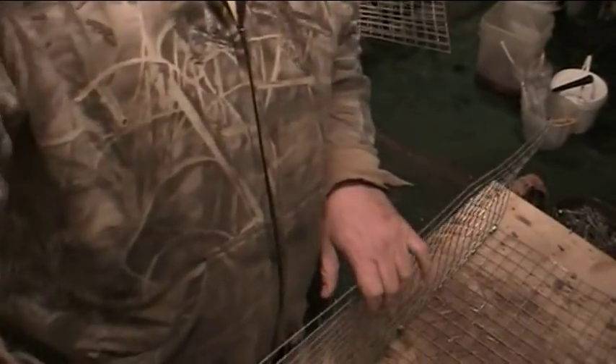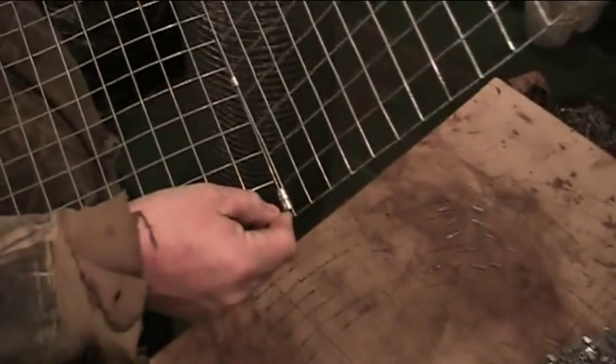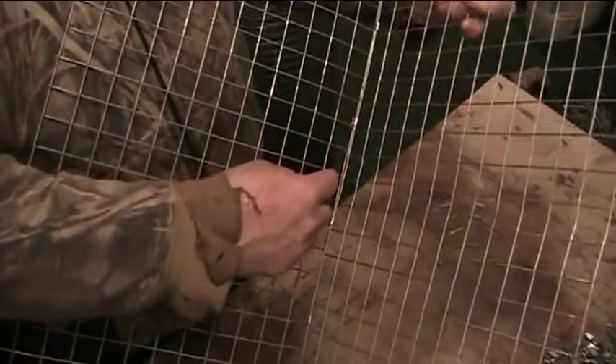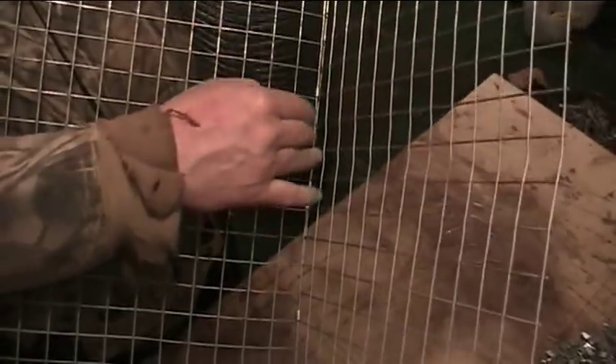So you see here we've got all four pieces cut out — 36 inches long, 12 inches wide. The first one is put together. When I use j-clips I put one every fourth hole. Put two on the end so that at least one spot has two, which stops it from sliding too much. Three spaces in between, so every fourth one — unless you think you've got really tough muskrats where you live, then put them closer.